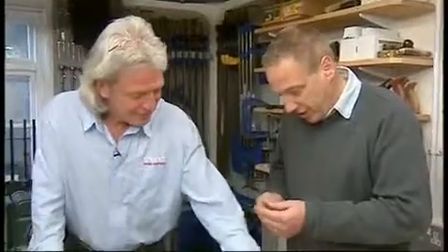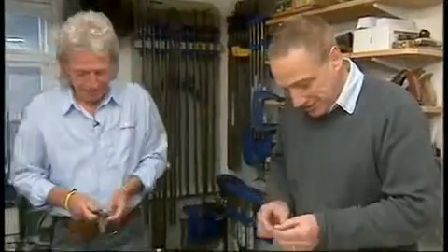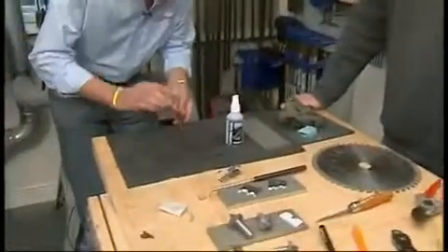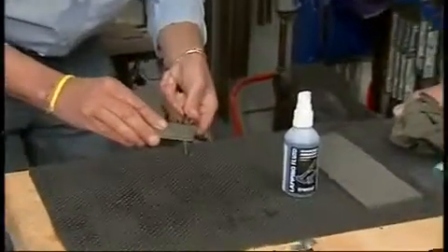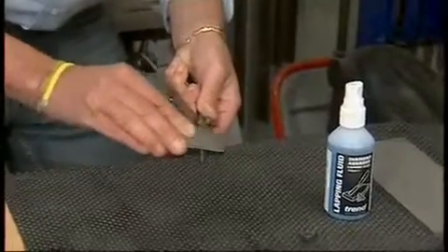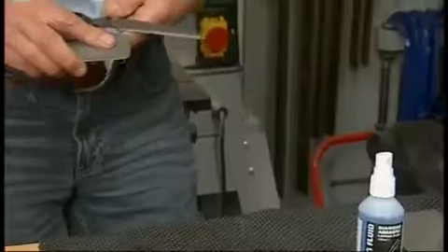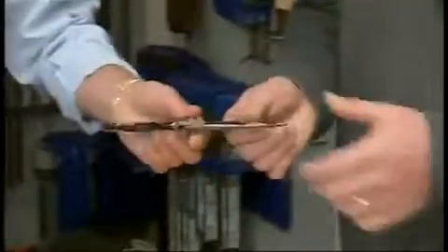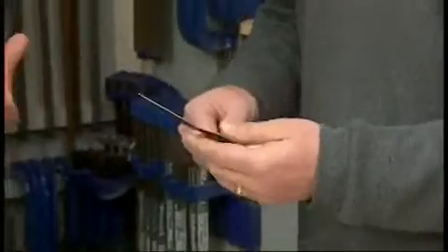You can do all your utility knives on that — almost shave with that one. Even with scissors: bevel edge and flat edge — level those off, come down flat here in a light circular motion. You can take this down your scissors, take the back off there, and they are absolutely superb.